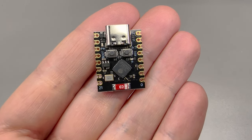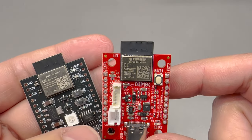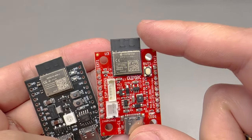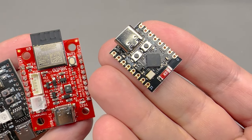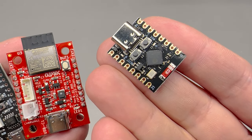When you really need the space savings, this makes a lot of sense. I'll be placing links in the description below to all of these products. The previous two modules were using the ESP32C3 mini module from Espressif which includes a PCB antenna, but for this one they're using the chip directly on the PCB and have added a small surface mount 2.4GHz antenna, which takes up less space.